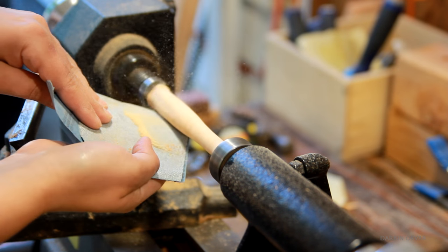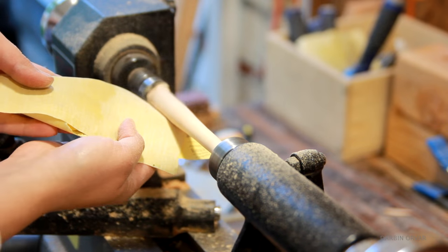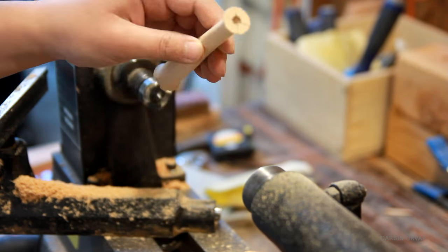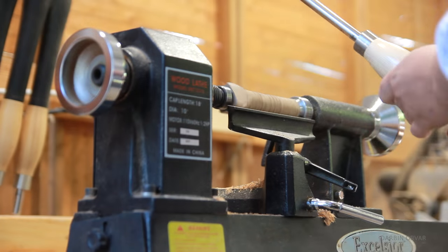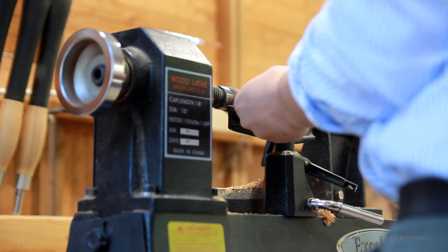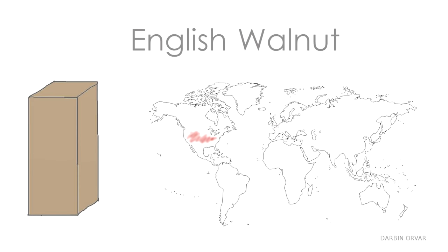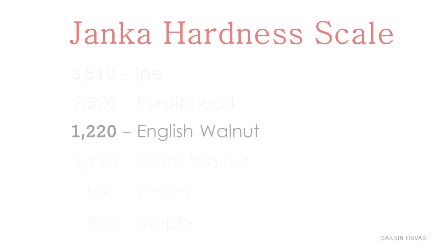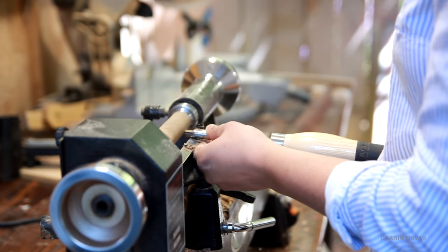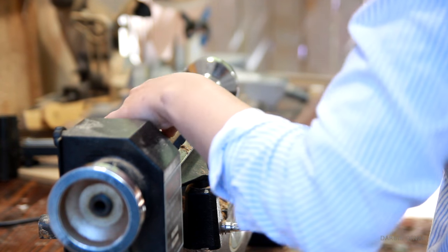Here I was getting a feel for what shape in general I wanted to replicate for all the other handles. English Walnut next, also called Common Walnut, which generally is a little lighter in color than black walnut. English Walnut is grown in a lot of places, but primarily Eastern Europe and Western Asia. It measures 1220, so a touch harder than the Cherry. It's also really nice to turn, and I like the lighter color.